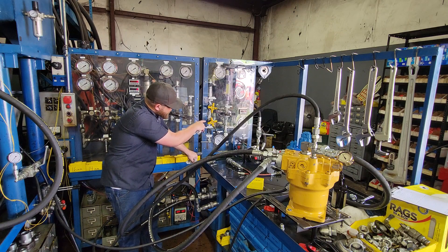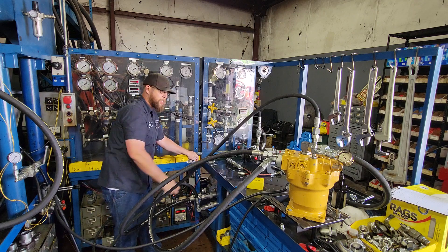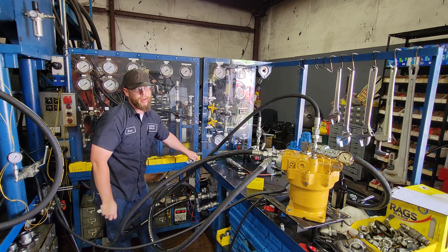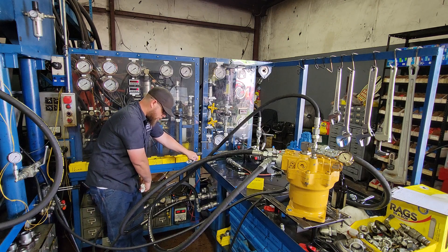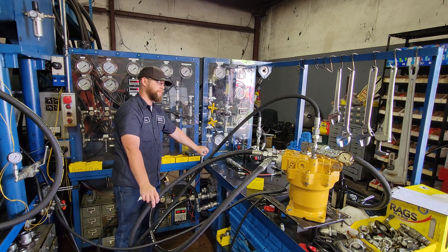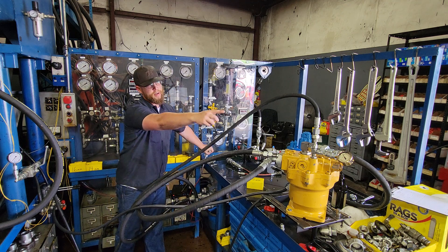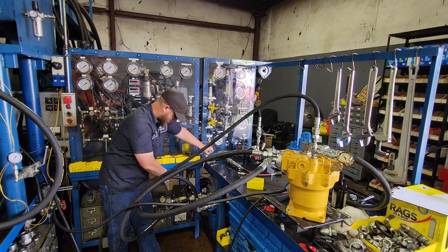So I drop — now it's going to build up. It's at about 4000 PSI. The shaft is not spinning. We don't have any leaking coming out of the bottom. Right now the case pressure reads zero. I've got zero case flow. I'm going to go ahead and shift it the other direction. Once again we've built up our 4000 PSI. We have no case pressure. We have very low case flow.